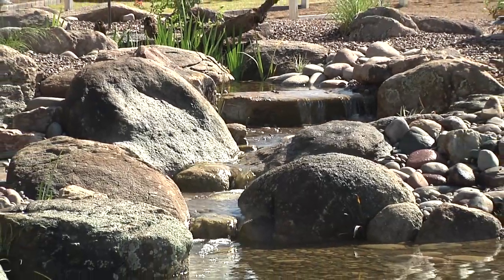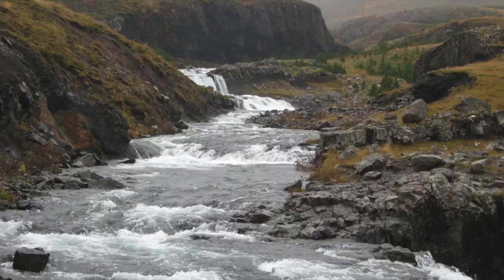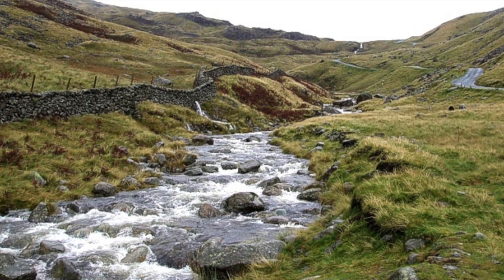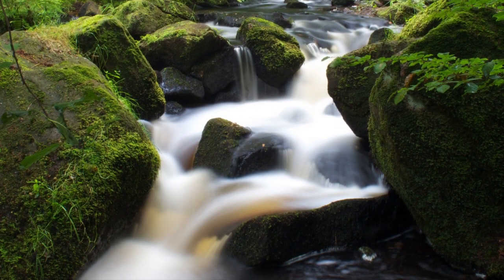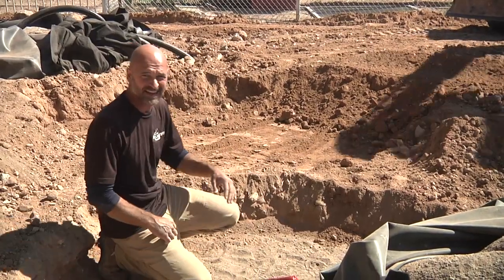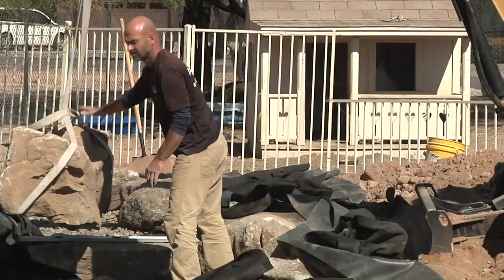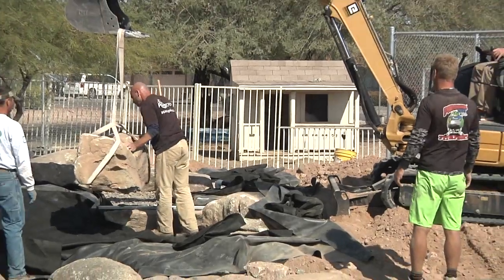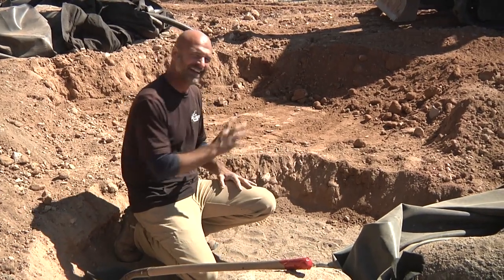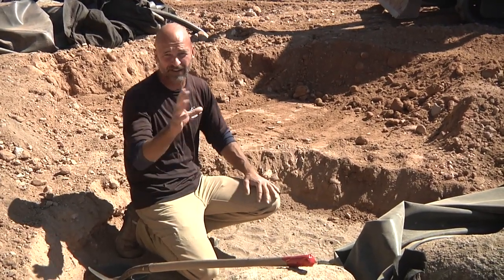The top waterfall is going to be facing people as they come walking in. Think of twists and turns — think of a water course. Water is very simple: it wants to take the straightest path possible going down a hillside. But when it hits an immovable object like a big giant boulder, it moves around the boulder and carves its way through the weaker area. So we come in with a big giant boulder on this side and a big giant boulder on that side — those are called our framing rocks. The water gets forced in between them, just as you would see in nature. We're working with natural stone, so we have ideas on how it's going to look, but it's an organic process. We set one rock, and that rock tells us what the rock next to it is going to look like. We try to keep those basic design philosophies in mind all the time.